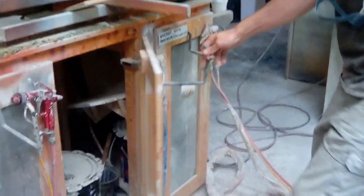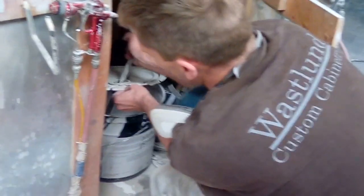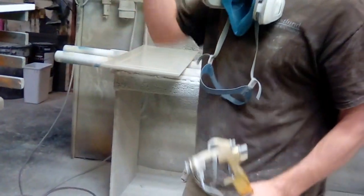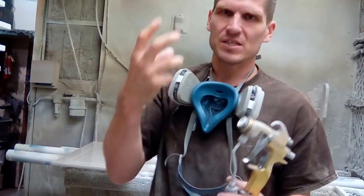Those are giant. I'll show you how to spray this new Aqua Primer that we got. It's a water-based primer. It takes a little longer to dry, but so far I really like it. It's supposed to help bond better with the wood because it actually raises the grain.